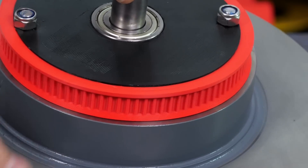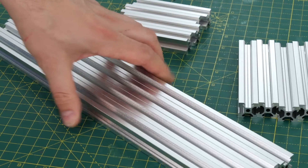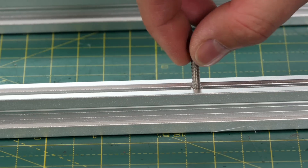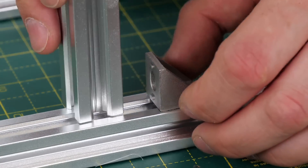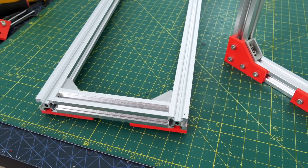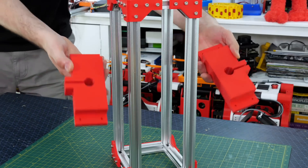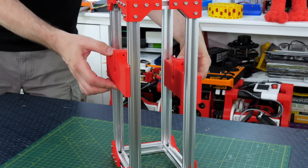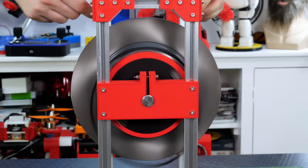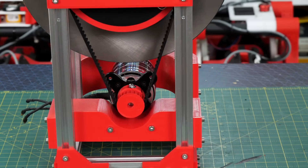I fitted a pulley onto the hubs so we can drive this with a motor, and I'm going to be using the brushless 6374-149KV motors from Hobby King. The frame is going to be made out of 2020 extrusion. I'm using drop-in T-nuts so I can attach 3D prints and various brackets, and I've also got some metal corner brackets to make sure I get my 90-degree angles right. At the bottom I've got the 90-degree metal brackets and also 3D printed brackets across all of the corners. I've only got those at one end because at the other end I need to put the motor and the disc mounting brackets — a couple of clamps which hold the 20mm bright steel bar and the disc, and I can position those up and down to tension the belt drive. The disc fits in there and spins around nicely, and I remembered to put the belt on so I can spin that with the motor and don't have to take it to pieces. At the bottom there's a motor on brackets so I can move it up and down and get that belt tension, and I've just 3D printed the pulley on there.